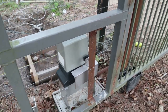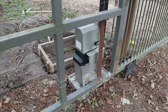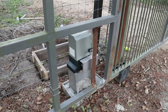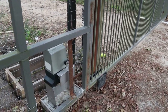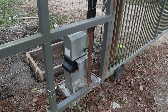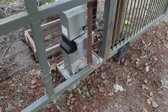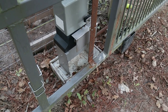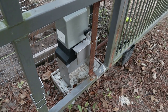There's a relief handle on the back of the motor with a key lock — you can open it up and release the pressure. But if there's a lot of pressure on there, as there was in this situation with a 3,300-pound motor, I broke the handle off of it. That was simply because the pad itself did not have enough concrete at the base to keep the motor stable enough for the sensors to function correctly 100% of the time.